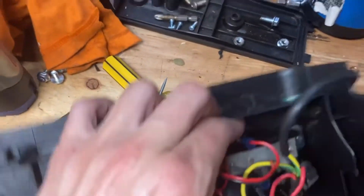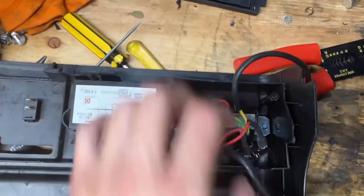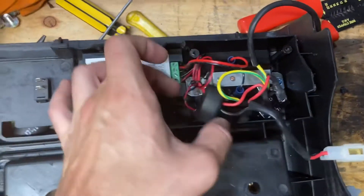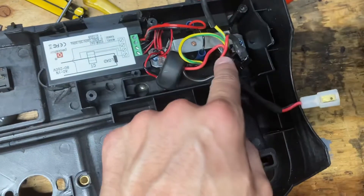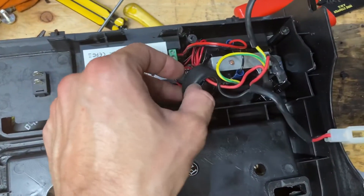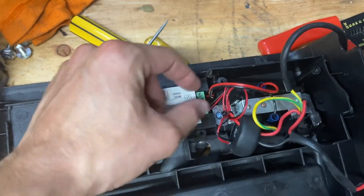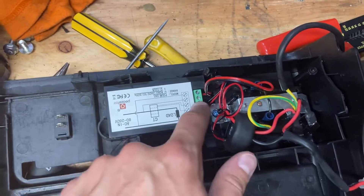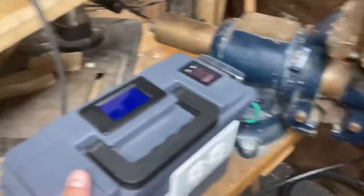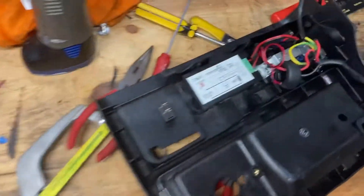Successful installation on the wiring. I went the extra mile for the voltage sense wires and used fork connectors to attach them to the outlet. I actually had to take the outlet out to access the screws on the sides - there's one screw down here and one on the right side - but after that came out I had full access. Then I added the coil on the hot lead, which is red - I believe it's the side with the overcurrent protection, the circuit breaker. It shouldn't really matter it's AC, but that's the lead I put it on. I attached the four wires to the proper terminals: the top two are for the voltage sense and the bottom two are for the coil, as shown on the little diagram. I noticed the sticker is upside down, but checking the button orientation against my test set confirms I got it right.